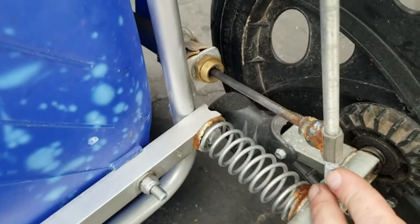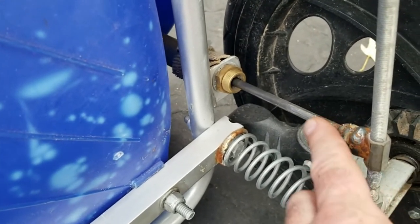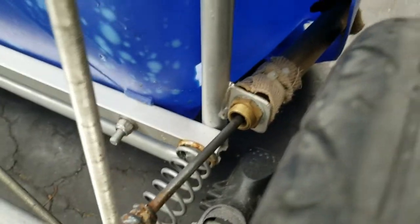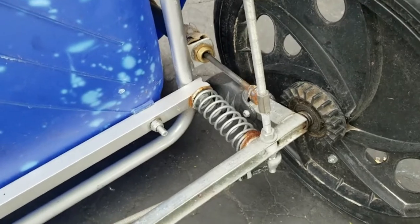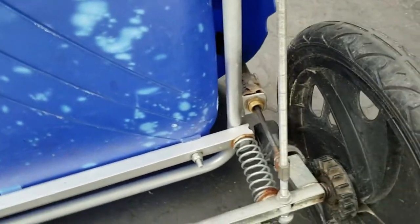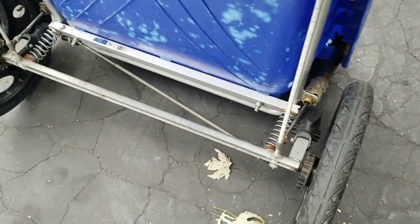To attach here, I just took a tube nut, put it on there, a couple of other nuts welded under the side, then ran that rod down into those nuts and welded that. This bronze thing here is actually an air actuator for machinery. Mountain bike springs are expensive — this spring was about six bucks. On eBay you can buy used air actuators for probably ten bucks a pop, and they give you just enough damping so you don't get a bunch of bounce.